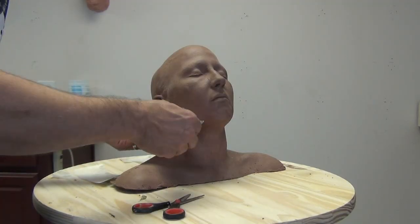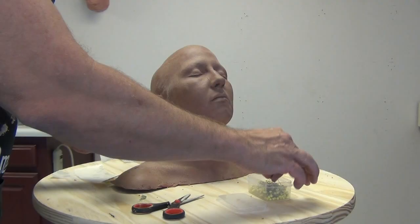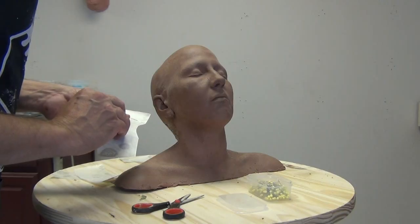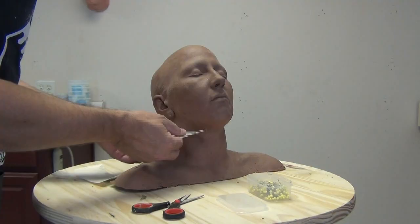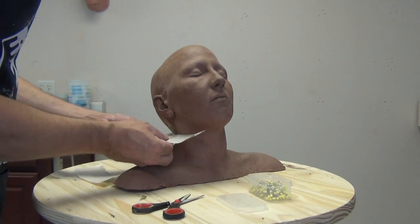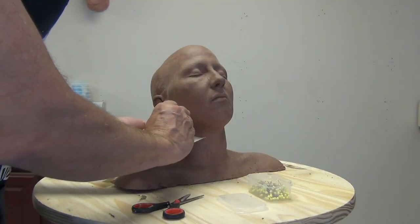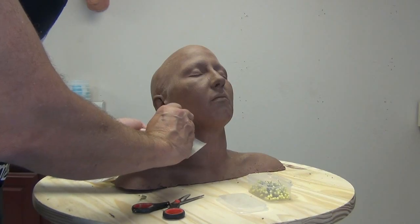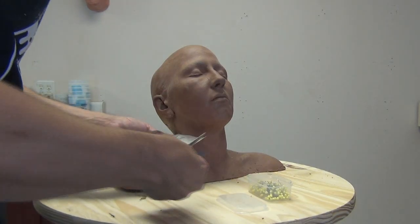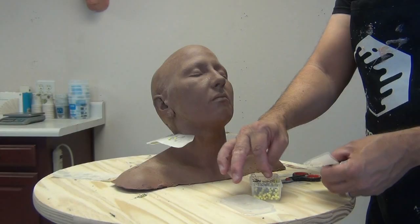By using wax paper cups to create a dividing wall and pinning them in place with quilting pins, this does minimal harm to the clay sculpture. When I peel off the silicone mold and remove the shims, I don't have to do a lot of corrective work to get back to the original clay sculpture. This is a good technique when you want a clean flange on your finished mold but don't want to use brass shims or build a clay wall — it's much faster and cleaner.